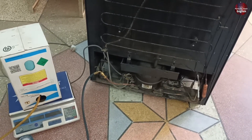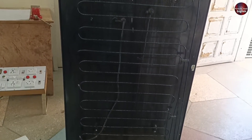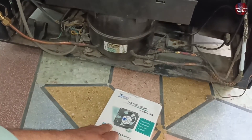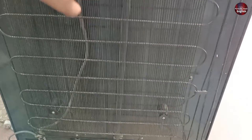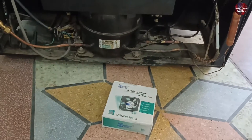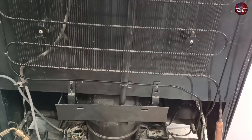This refrigerator is a natural air-cooled system, so we will try to cool it through the air using a fan. A myth is circulating that cooling the refrigerator compressor will increase its performance, but actually the need is to cool down its condenser. The cooler the condenser, the more the performance and efficiency of the refrigerator will increase. We will use a DIY method to install this fan with the refrigerator to cool the condenser.